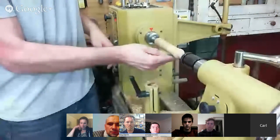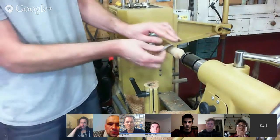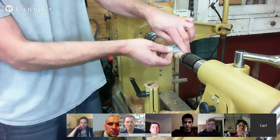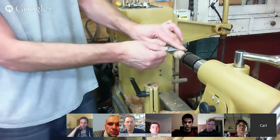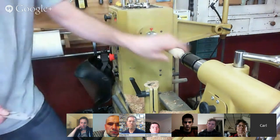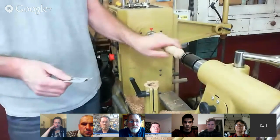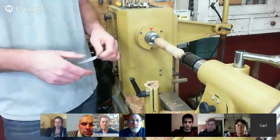So just hit it like that. I'm just doing it with 180, but I'll finish this after we're done here. Just go back and forth like that. You don't need to run it up. This is, you know, too high. This is the tool handle, but it makes a nice clean cut. I was talking to Mike the other day too, and he said that he actually stops the lathe and runs with the grain direction too, and that gets a nice clean finish. I haven't tried that before, but I might give that a try.